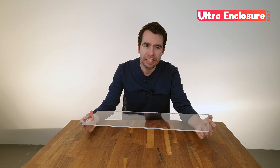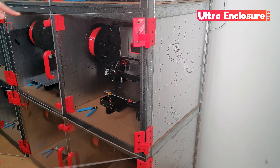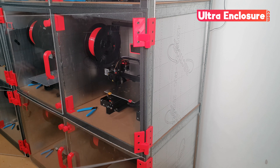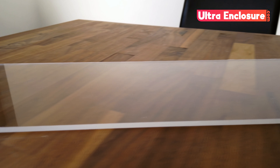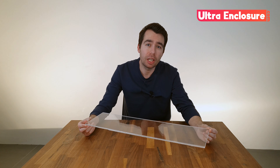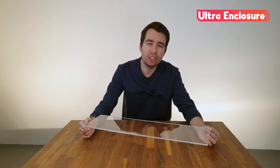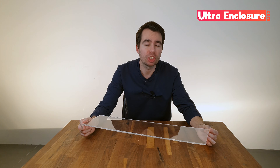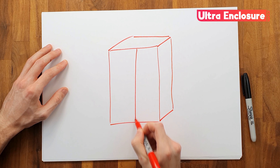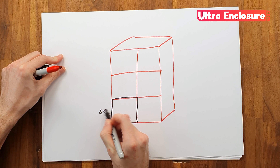The last major supply we'll need is acrylic. You may know it as plexiglass, perspex or acrylite — they're all essentially brand names for the same clear plastic sheet. This acrylic will form the doors of the enclosure and I'd recommend a thickness of at least five millimetres. This will give you nice strong rigid doors. Any less and you might find that they start to droop and wobble during use. There are two main options: you can either buy the sheet material and cut it down yourself, or there are some retailers that offer a custom cut service. If you go down the custom cut route this could take slightly longer to arrive and maybe be slightly more expensive, but could be a good option if you're not very handy with tools. If you do go down this route I'd encourage you to hold off ordering the acrylic until you've assembled your shelving unit. This allows you to measure the exact dimensions you need and will minimise the chance of any errors.